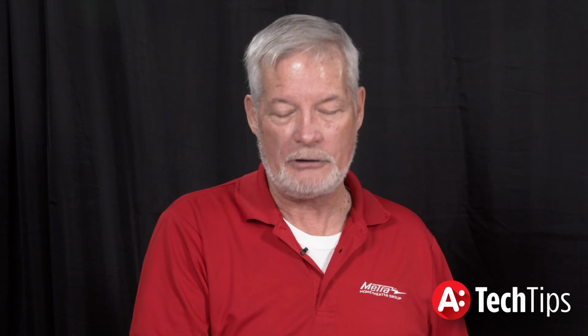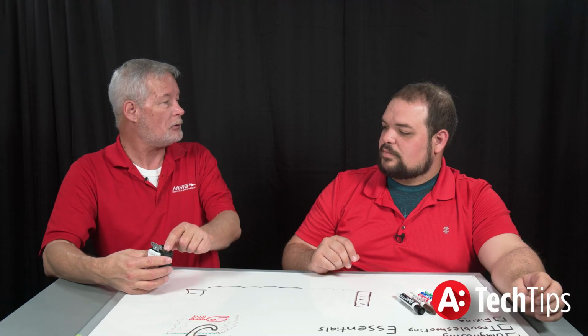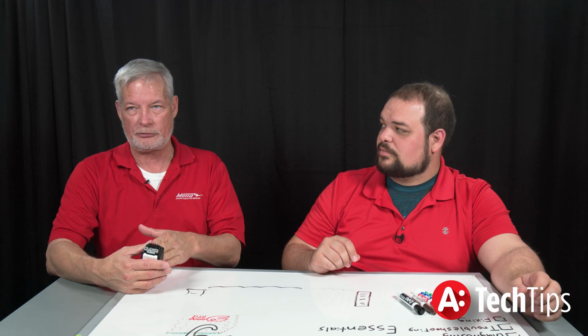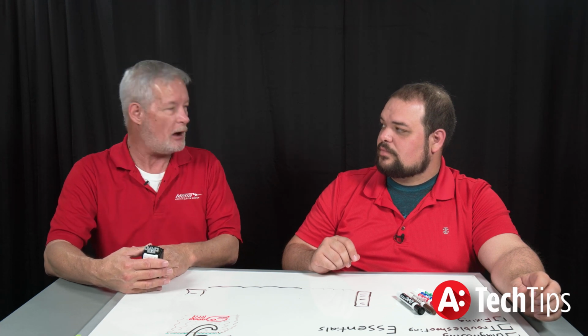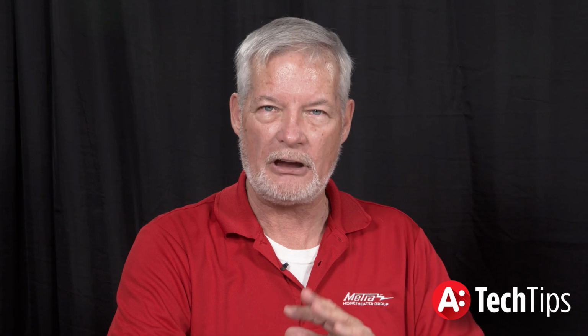Now, it could be that the line and the neutral are reversed on an outlet. Or it could be that the ground is not properly done. This is why you don't want to do this yourself, because you do not want to take ownership of that 110 volt system, unless you are a licensed electrician. It can come back and bite you. Please do not get into that if you don't understand what's going on. If you're not ready for it, don't do it.